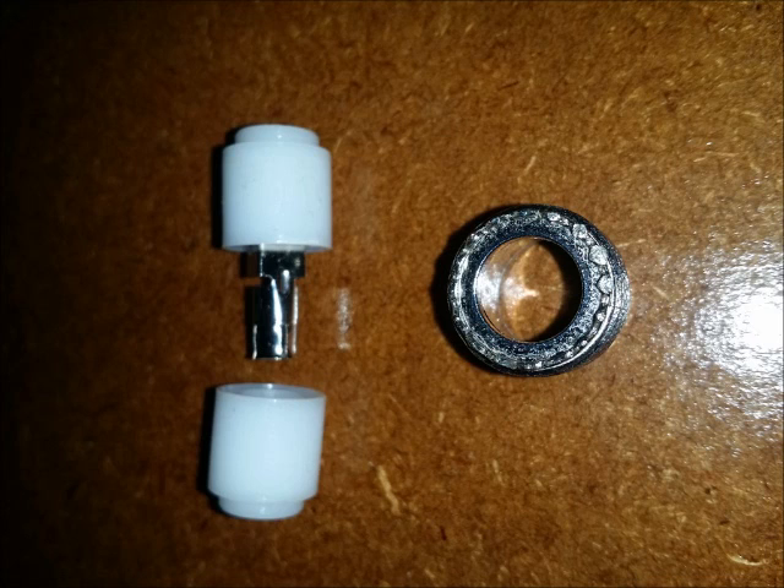The metal piece was also halved, where I connected the live wire, or the RF connection. As you can see, it then got also connected to the 50 ohm coaxial cable. Something that I did there is I took a round piece of rubber, cut it, and inserted it inside just to prevent the center pin from shorting with the brass plate at the bottom.